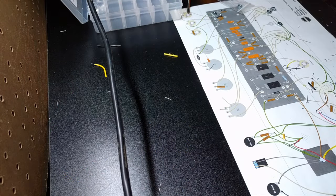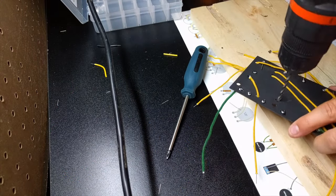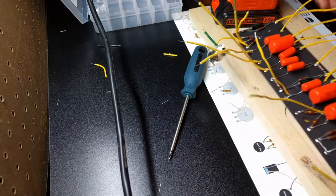What you need to do is find out where you can push a screw through the chassis, through the backplate, and cleanly through your wiring board without shorting anything out. There are some pre-drilled holes in the chassis, and with a little bit of movement of your board, the way they've got it set up, it shouldn't be that hard to find. But it is a bit of a task, and I would recommend that you take your time here, because you don't want to short out anything on your wiring board when you're attaching that screw through the chassis, through the backplate, into the wiring board.